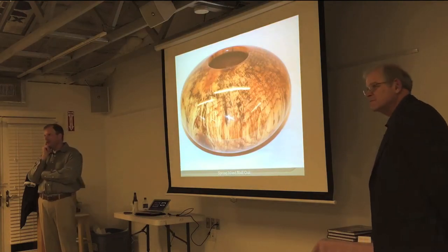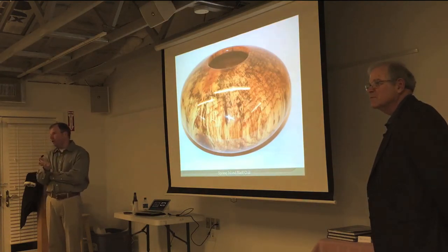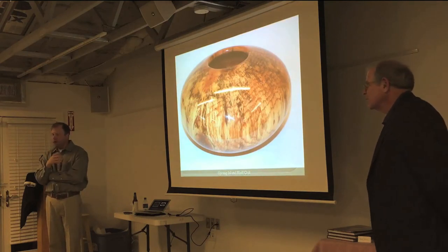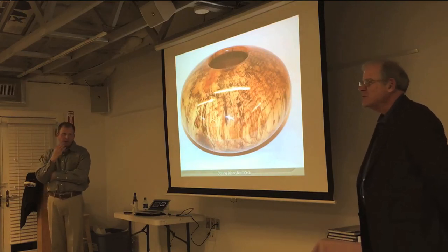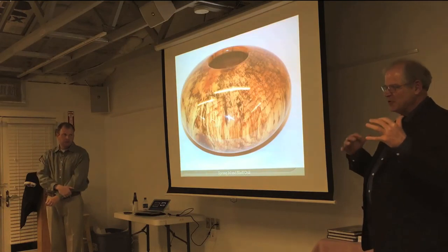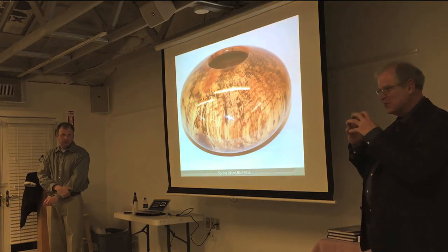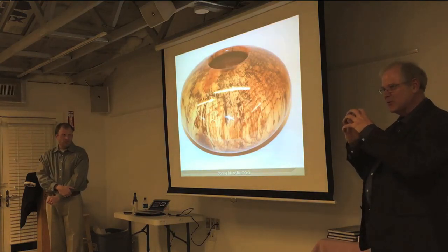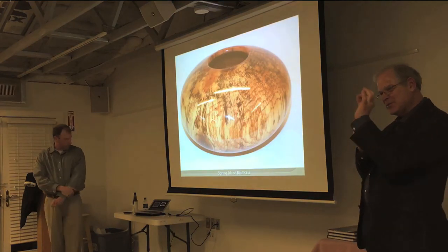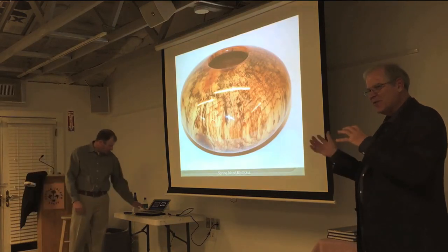Yes? You talk about restoration. Over 30 or 40 years, how likely is a bowl to crack? Zero. But things get mistreated or mishandled. I mean, we've had moisture issues in the basement of a museum before. To be fair, it could crack. It depends on the conditions. If it goes from higher moisture content into really dry, wood will move forever. It doesn't just freeze and never move. You watch old furniture tables, where the legs join, you'll see the cracks depending on the wood. And these will move too, but if they're dried well, they shouldn't.